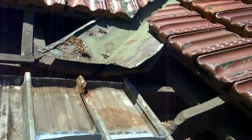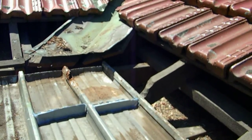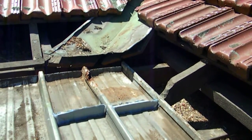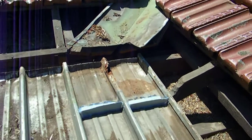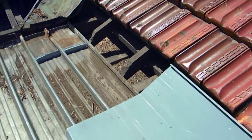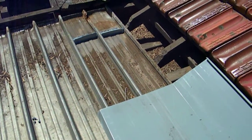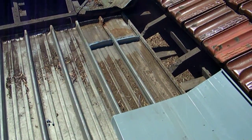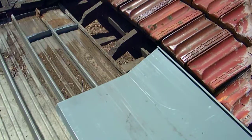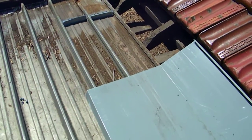The two upturns are strictly not quite necessary, but we've put them in there anyway as a precaution. This new flashing — it's called a tile flashing — actually covers those two pans that are rusted, so water in theory will not get into those two pans anyway, but we've done it as a precaution.